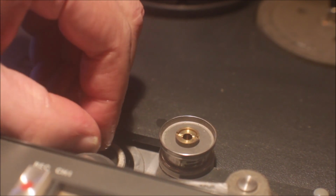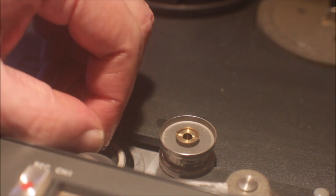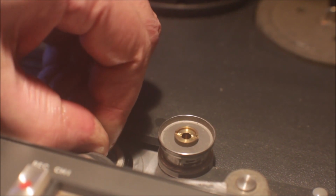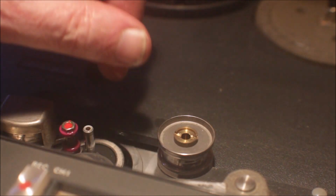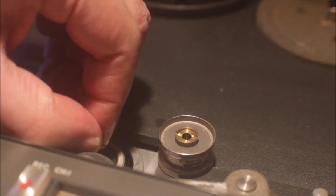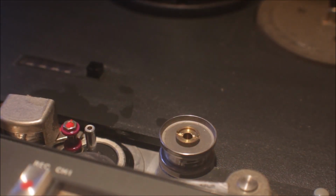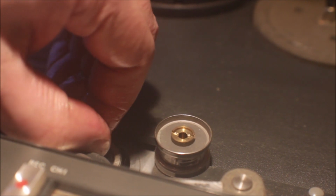The capstan motor is what determines the speed of the tape, nothing else. Okay, I'm going in reverse now, sort of jogging it back and forth. It's a synchronous AC motor. It should hypothetically start to respond to all of this coaxing that I'm giving it. No, slowly seeping in that oil. No, it's reluctant to cooperate in any way.